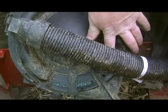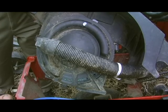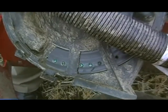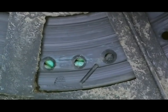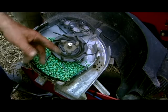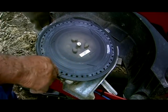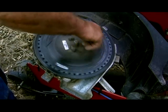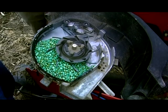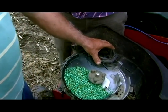This is like the old planter plate farmers used to have — it drops a seed every so many inches, and you've got to get those inches just right. This little disc keeps turning; every 17½ feet, which is a thousandths of an acre, we plant 34 seeds. The seed disc turns, vacuum fills every hole, and it drops the seed out. As seed is used, it's refilled from the central hopper via air. A small agitator piece keeps it stirred so you don't have buildup.